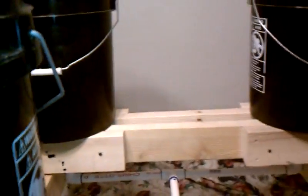We've got Y's coming in, 45's — man, I just learned plumbing, I don't know this stuff, I'm learning on the first day. So we come into some T's, run it down here into the center, which has a barb fitting. This will allow me to hook up a pump to it, so I can put the pump in the bottom of the reservoir and have it pump the water into the bottom of the buckets, which then is going to drain out into the reservoir through the one-inch fittings.